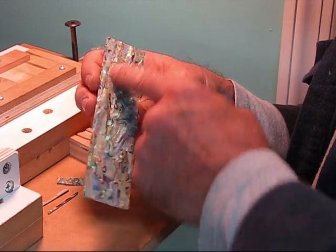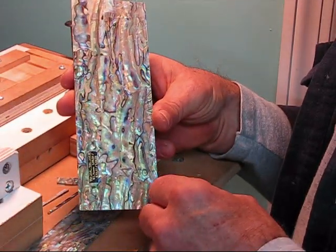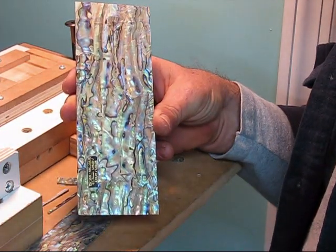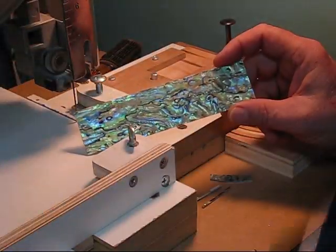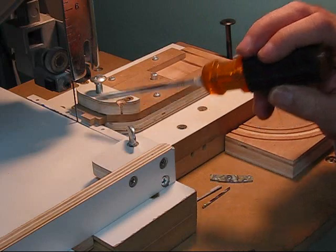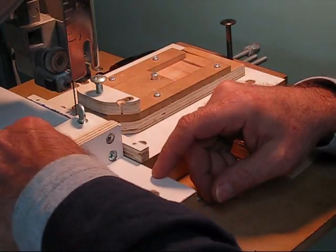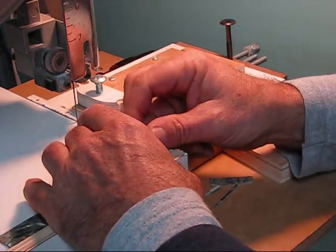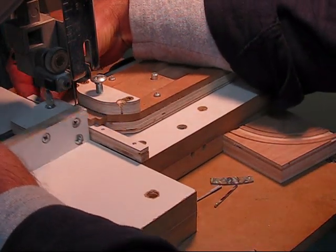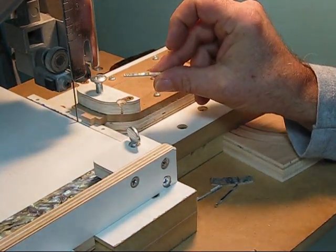There are also places where the laminates were layered up — that won't look very nice in the inlay. This is my jig that I use for cutting. It simply has a stop right here that goes in and out, and a fence right here. I load the piece in, it takes it up to the stop, tighten that, and that holds it. That's my piece — that's how I make them.